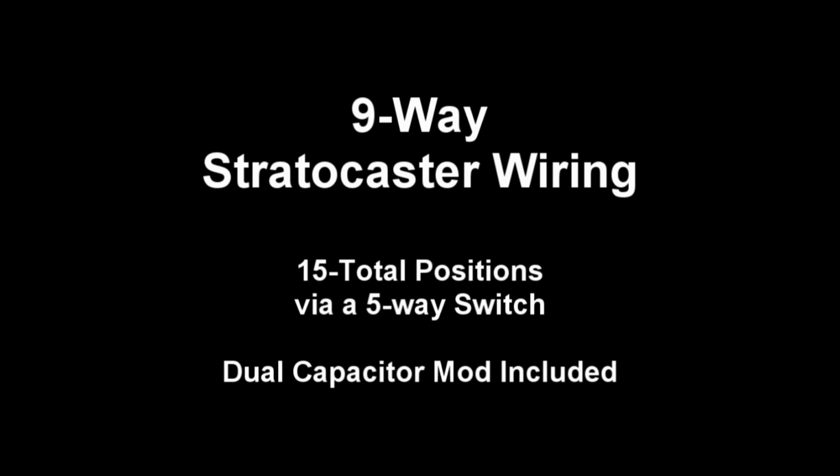Today's video is how to wire up a Stratocaster for a 9-way mod. This mod basically gives you 9 unique pickup combinations, but through the combination of a 5-way switch along with an on-on-on toggle switch, you have a total of 15 different positions to play with. And because so many of you like the Dual Capacitor Mod that I have out here, I've also included that. So not only are we getting a 9-way wiring scheme, we're also getting the Dual Capacitor Mod.